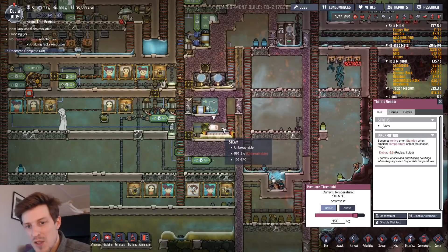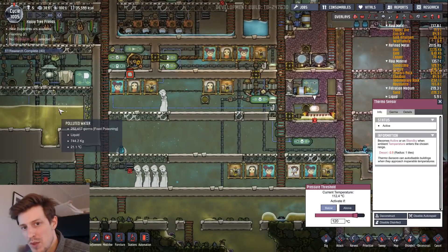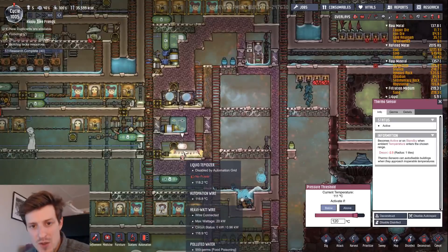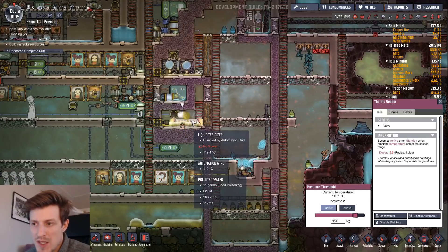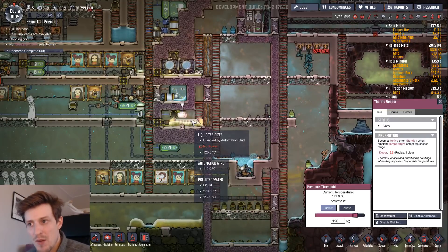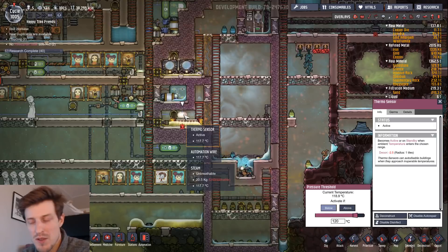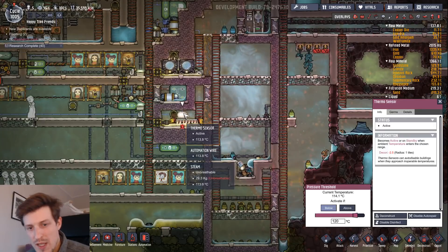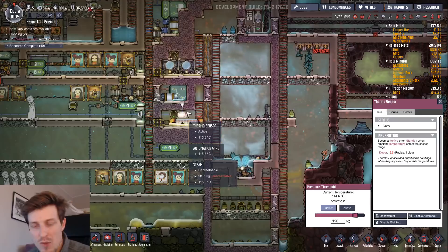The main problem is if it's not something you use all the time, but just start up once in a while — like for me, I only want to start this one if I actually have too much polluted water. If you end up having too much polluted water, this is what I use to burn it off and boil it. If you haven't used it for a long while, the surroundings will be kind of cold. So if it only heats for five seconds before the power is cut, it might not be enough to actually hit the level of the thermal sensor, and then it will stop functioning because the power will never be cut. If you set the threshold low enough to make sure it hits those temperature levels, that might not be high enough for the intended purpose or maximum efficiency later on, because the power will be cut too early.